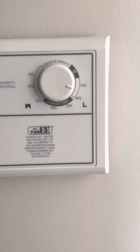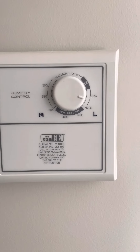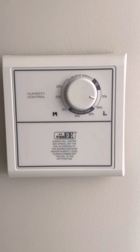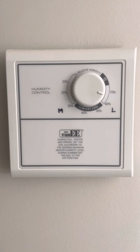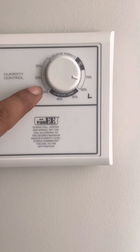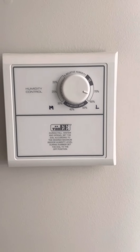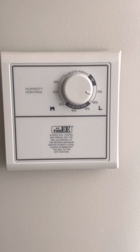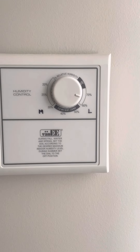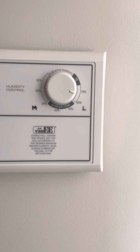So if there is no humidity, set this knob above 50 percent. If there is humidity, set your knob below 50 percent. But avoid setting below 30 percent — if you set your humidity level between 0 to 30 percent, it will make your home too dry inside and you will not feel comfortable.